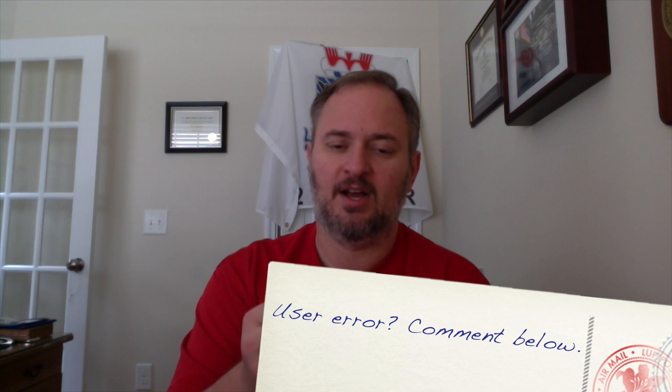So basically: make sure you've got a good face, we're drilling it with a letter F drill, then we tap it — it's five-sixteenths. I put this front chamfer on, and here's where I ended up having to do some work. I couldn't figure out how to do the rear chamfer in Path Pilot — it wouldn't let me do that. Then when I tried to do it with the parting tool, it told me my orientation in the tool changer was wrong. So maybe I've got something set up in the lathe wrong — if you've got some insight, please let me know.